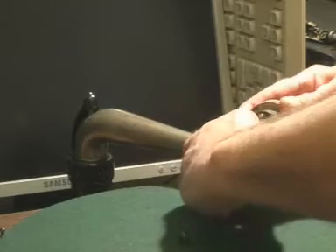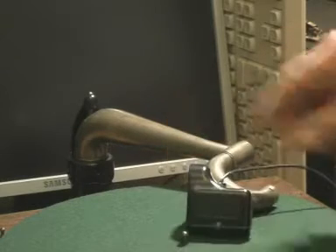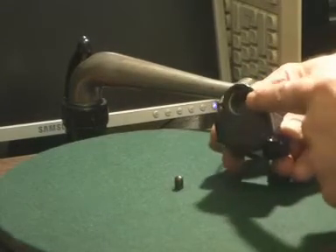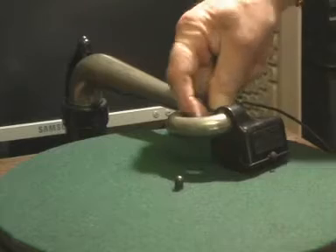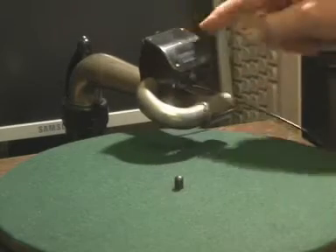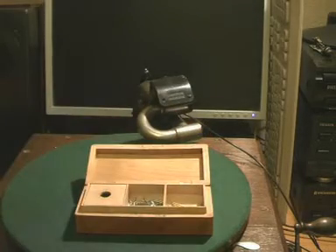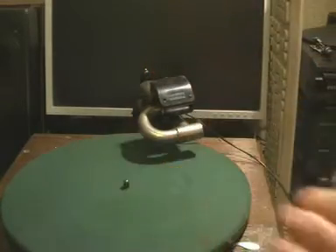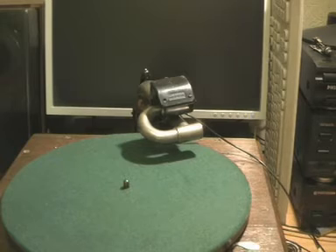So let's fit it to our 1921 gramophone. First we remove the original acoustic soundbox like so, and put it carefully to one side. Here is the working HMV Number 11 soundbox, which is provided with a joint with sleeves as an adapter. It goes in like that, then we tip it back like so. There's a little nut at the back to stop it flopping about. Here's a box of needles — we'll take one out, put it in, and screw up the needle-retaining screw.